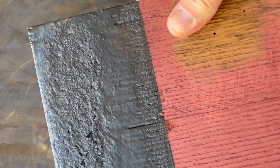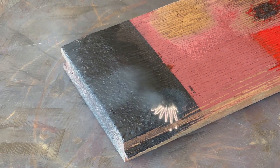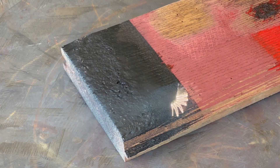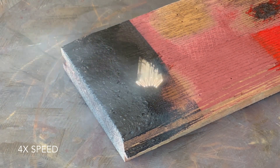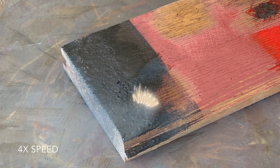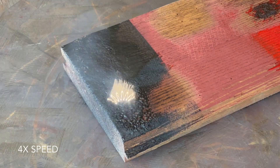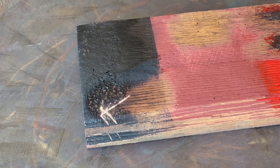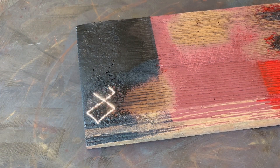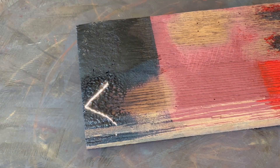Here's a close look at the truck bed coating — I filled the grain in the wood and kept adding coats until it was 2–3mm thick. Not that you would ever apply thick truck bed coating over oak, but I wanted to test the limits of the pulse laser. It worked pretty well on areas that weren't very heavy. On the heaviest areas, I ended up using the laser so long that it started to blast through the coating, but it also started to burn the surface. I went back to my custom saved mode and it did continue to remove the truck bed coating, but once the surface of the wood started to burn, it was only going to keep burning.